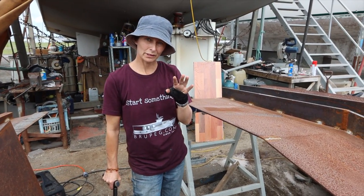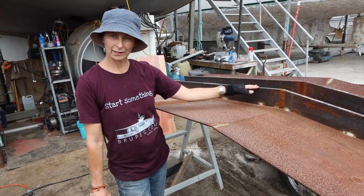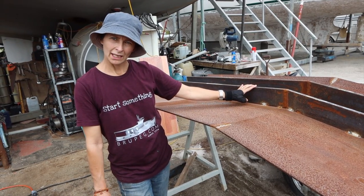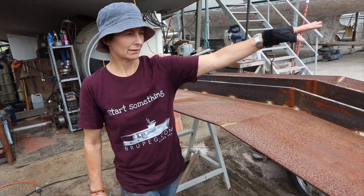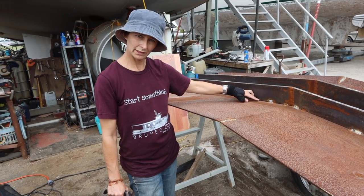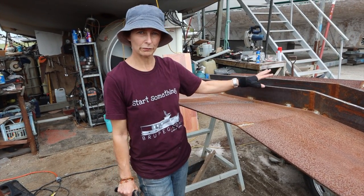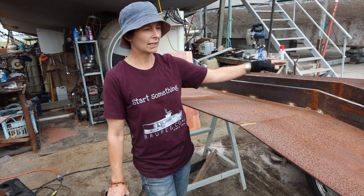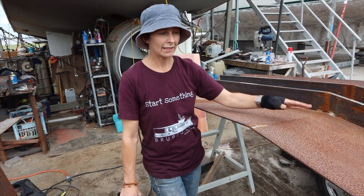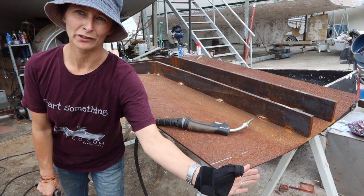I just want to take you through the steps that we're going to go through. Once the internal strengthening is on this, with the different bars that Dame's talked about going on, then it's all about the skin going on. But before we put the skin on, we've got to do a continuous weld along these lines here. So there's a lot of welding. If you look at both of them, there's a lot of welding that we've got to get through. And then it's fitting and welding on the skins. And then of course there's the ends, little panels at the ends for aerodynamics.